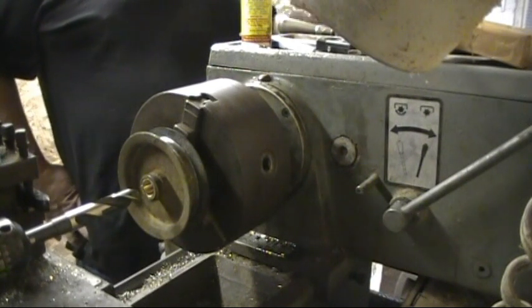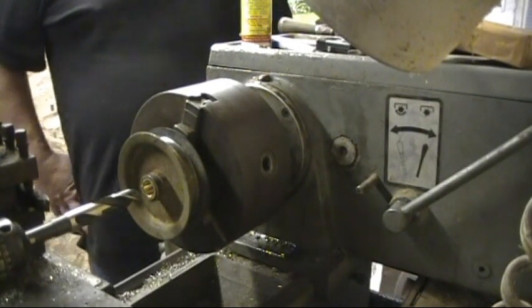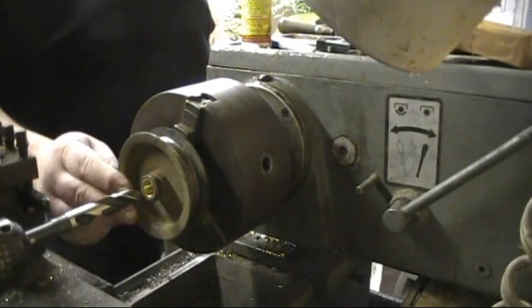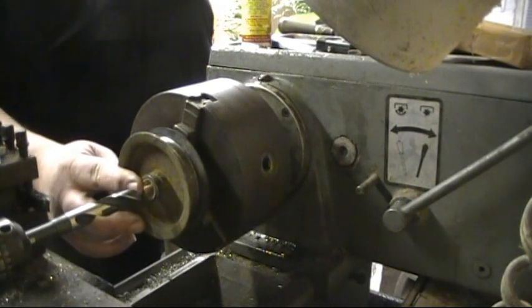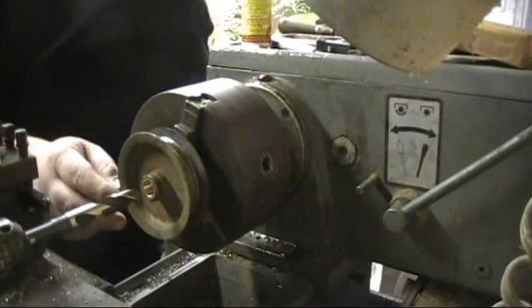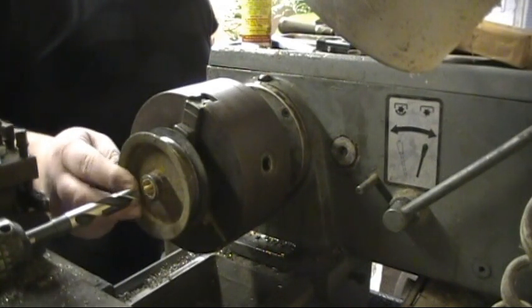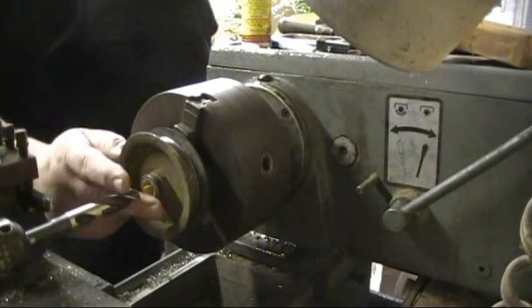We hit the bushing — we used a pipe fitting. Y'all watched me push the old bushing out. Had a new bushing, pushed it in there with the press. Didn't really have to — it didn't fit really tight. But I was hoping it would gall it a little bit and make it tighter. I chamfered each end off and cleaned the ends up. It's still a little loose, so I put it on a wood block and took the ball end of a ball hammer and tapped it a little bit to tighten it.